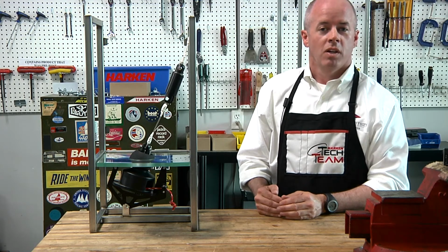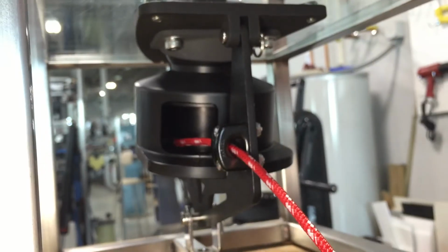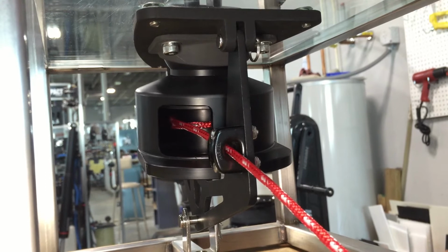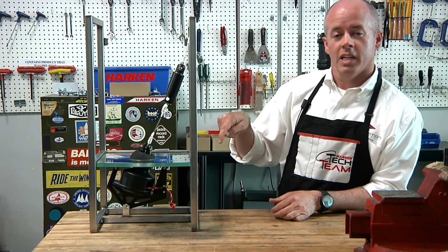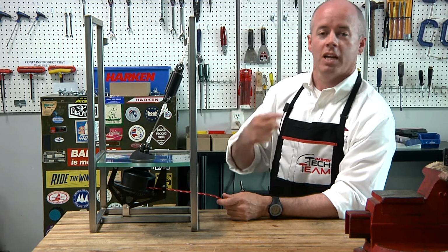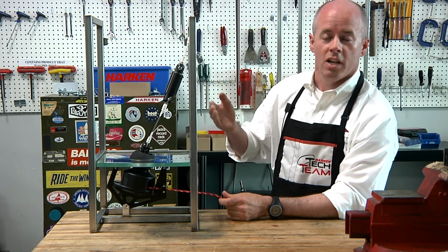We had one opening down here on the port side or left side of the furler where the line would go into the drum and wrap around the drum in a clockwise fashion, which would mean as you are furling, the sail is wrapping up counterclockwise and the clew would always hang on the starboard side of the roll.